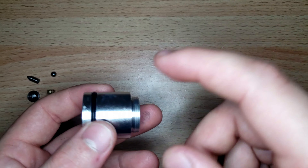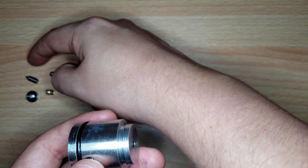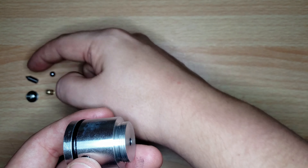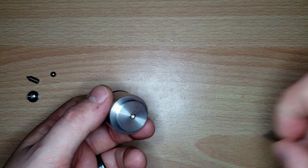Now we're reassembling the second part, which includes the brass piston adjustment, the steel ball, the adjustment screw, and the silver cap. The brass piston adjuster goes through the hole — ending up just right before the O-ring in the groove. It can be difficult to get all the way pushed in because of two ledges inside; it likes to get stuck. Apply a little bit of extra lube on the inside if needed.